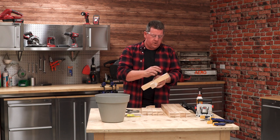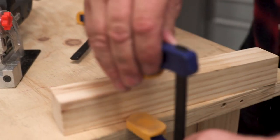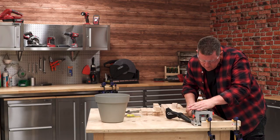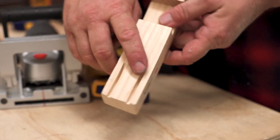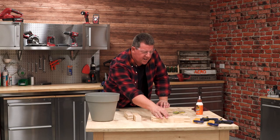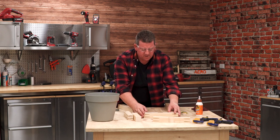It's time to put some slots into our cross piece supporting our pot plant. We'll need to put some slots in here and in this side, and repeat that on each one of those ends. Let's get to marking. We'll align our biscuit joiner differently this time by clamping it off on this end of the bench, and again aligning our red mark with our centre marks in the timber. Now we've got these two slots cut here; we're just going to repeat that step on this side and then on the other end as well, then bring in the other piece and repeat the same steps on both ends. Now that we've got all the slots cut in our cross pieces, it's time to try and form a bit of an H. I've just got two of the long legs, two of the short legs — create a bit of an H on the table.